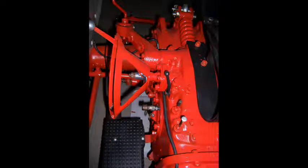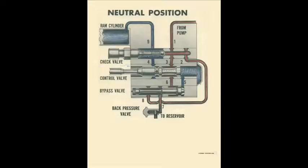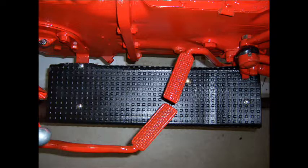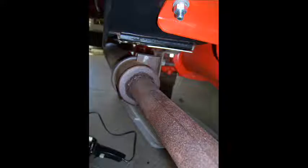Here's the quadrant control — up/down for the hydraulics and all hydraulic controls. I also included some diagrams of what the hydraulics look like in the neutral, raised, and lowered positions, just for your information. The next thing I did was I installed the footboards on the left and right-hand side, again painted with the truck bed liner for the resilience. Then I installed the exhaust because it's connected to the running boards. There's the muffler going out the back, connected with the bracket to the running board.